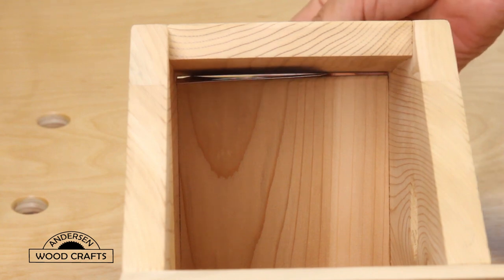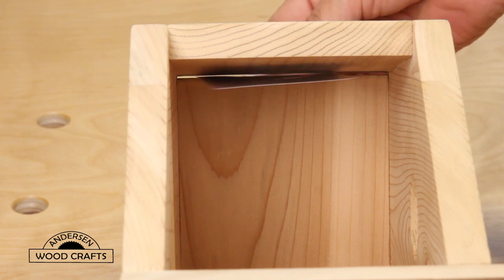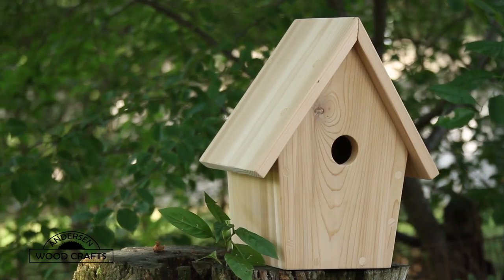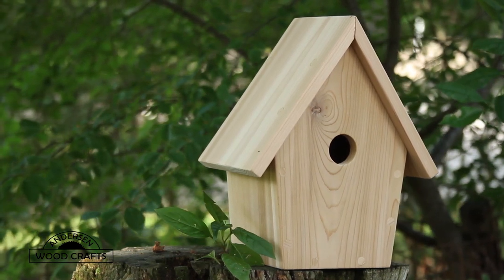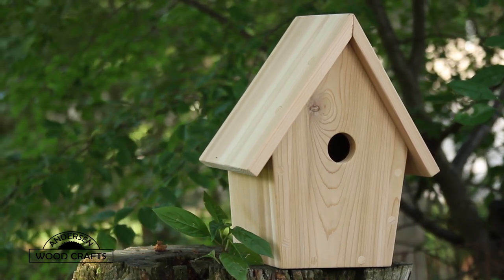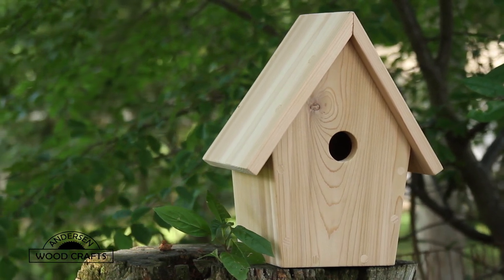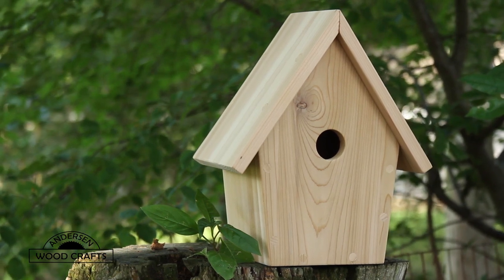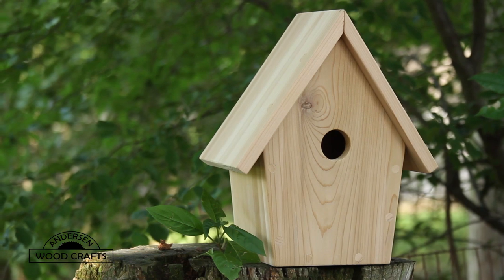You don't have to do the gap — you can just drill a hole in the side to provide the ventilation. And the same thing with the bottom: you need drainage. And there it is — a completely over-engineered birdhouse. If you take away some of my design elements such as the angled sides and the slits for drainage and ventilation, this would be a very simple birdhouse. But I decided to over-engineer it.